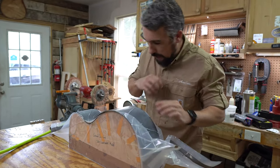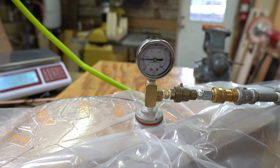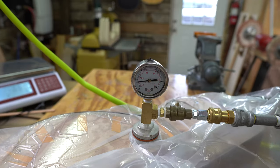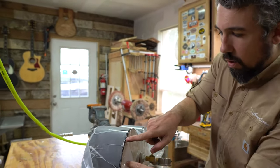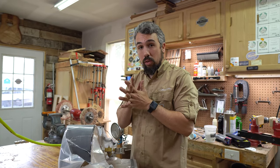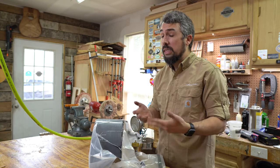We're pulling the vacuum and I want to make sure everything is nicely lined up. Then I'll flip it over and check the vacuum gauge. We should get to about 27 inches of mercury — that's the unit of measure for vacuum. A little bitty leak is fine, but as long as I'm pulling above 25 inches of mercury I'm a happy camper. You can see inside the bag where it's squeezing out all of the epoxy — there's literally no air between the two sides. You cannot get a better glue joint than with a vacuum bag. It's going to bond these two together and basically double their strength.